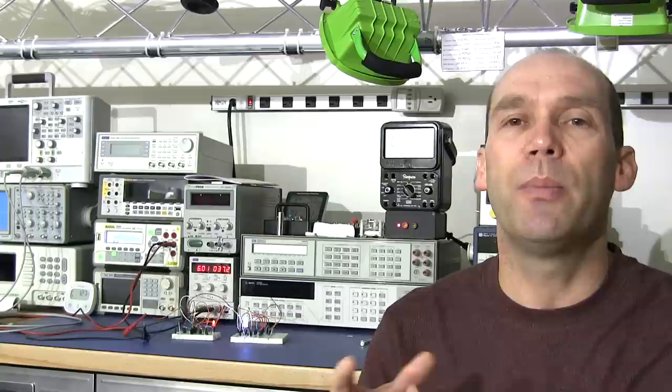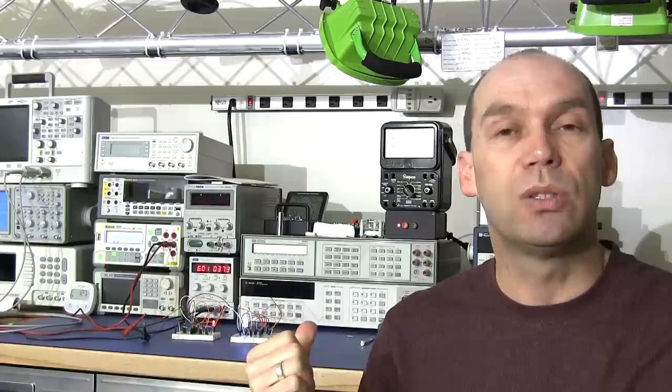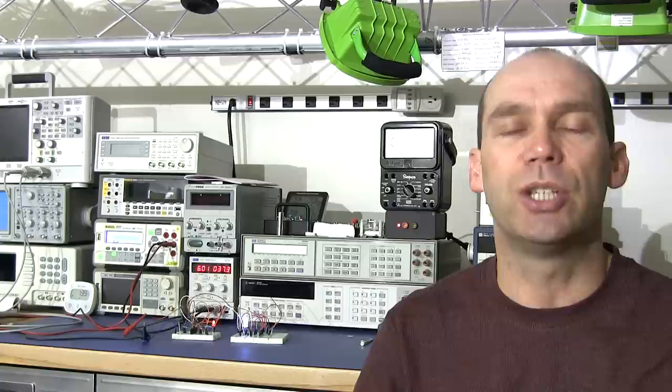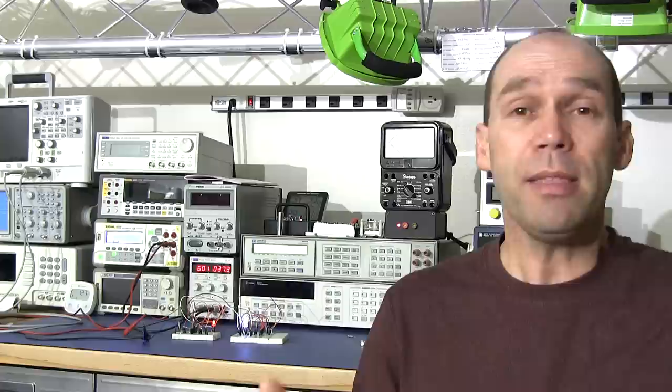In part one, I'm going to quickly show you the circuit and then go over some theory about the makeup of a 555 timer and how each of those circuits work. There's a latched switch circuit and then a pulse width modulation switch which drives an LED, allowing you to change or alter the brightness using pulse width modulation. This is perhaps a tutorial I would have hoped to do after completing transistors and perhaps getting into some logic gates, but nonetheless it's an interesting exercise.